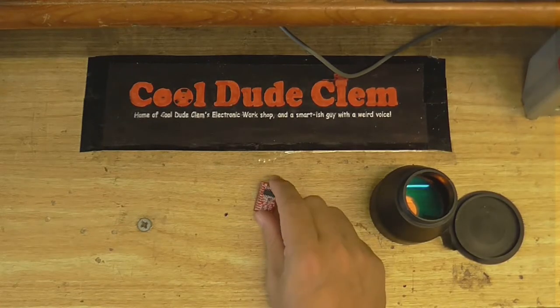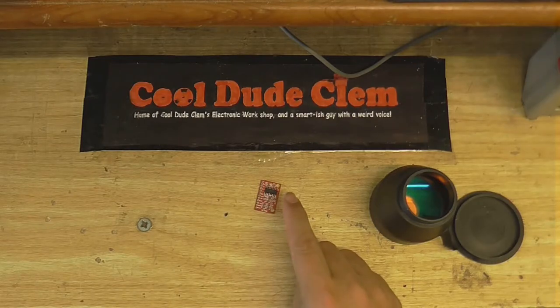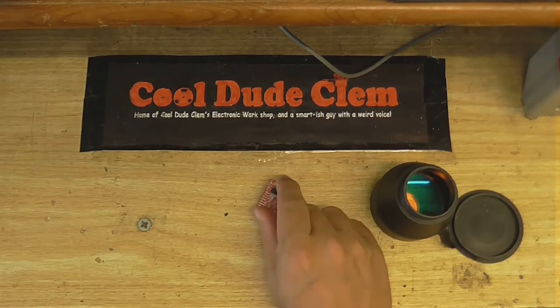It's very hard to follow the traces on the circuit board. So I'm going to try tying that high and tying that low, and seeing if the amplifier doesn't do anything. And this thing is 5 volts, so I could power this off a phone charger. So with all that rabble out of the way, let's wire this up and see if it does anything.